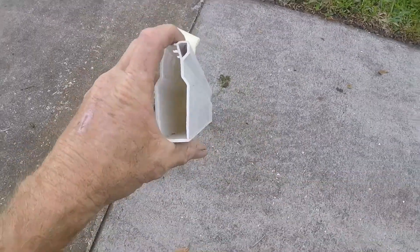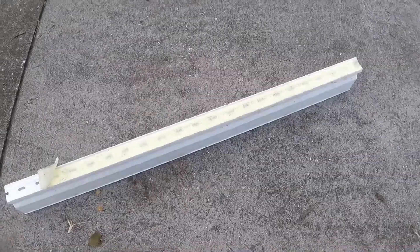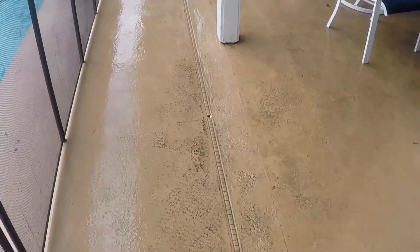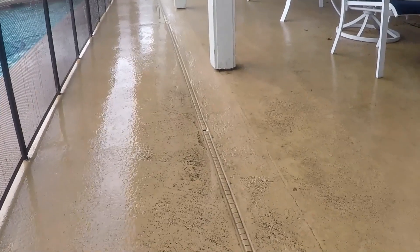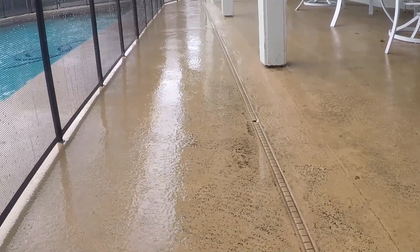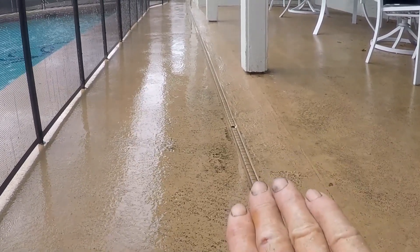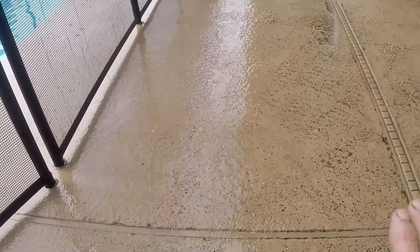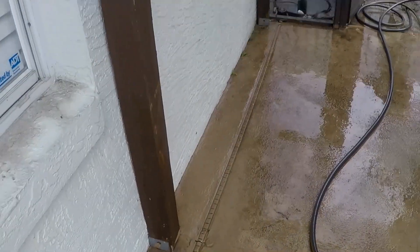Normally, a channel drain, even though it's this size, will pick up tons of water — it can keep up with torrential rainfalls — but you've got to maintain the system. If you look at this channel drain now, it's wide open, very nice and clean. But right there in the center you can see it's quite low. They actually made the concrete drop down into it as well because it's so low. Here at the end of the pool deck as it comes around, it's quite low, then it turns and runs back uphill over to the sump basin where we've got the discharge. There's always some water in the bottom and it only has maybe two inches of actual drainage — it's got to be maintained or there will be problems.